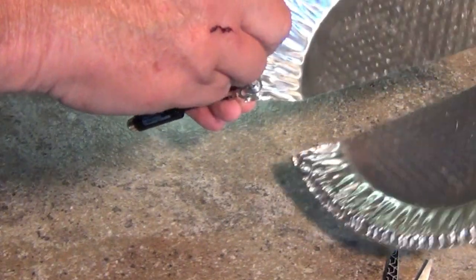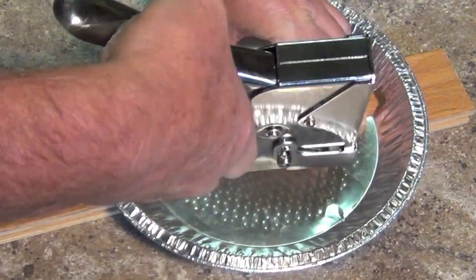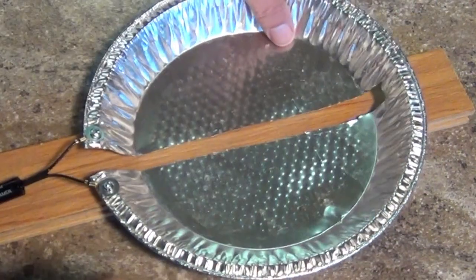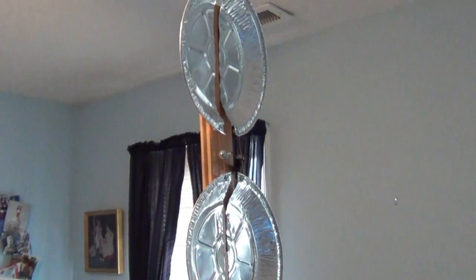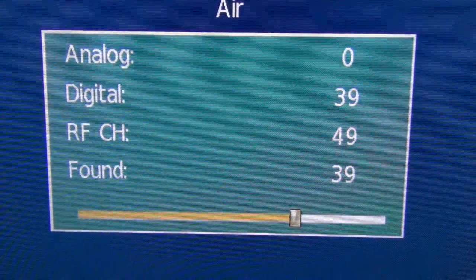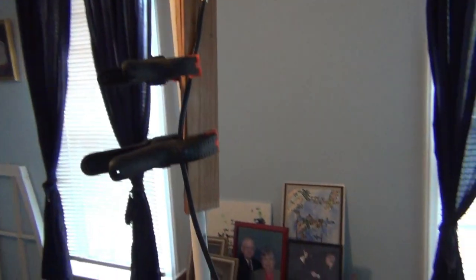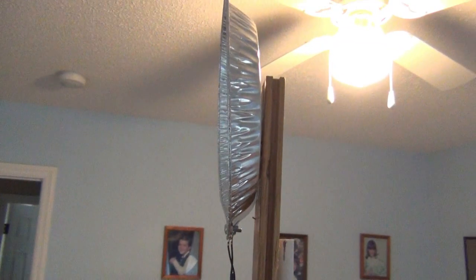Some of you want to know if I could do something to enhance the performance of this antenna — maybe in your location it just doesn't quite get the reception you were hoping for. After a bunch of tinkering and building, I've come up with a simple but effective antenna that I think just might help you out. So here is my second version: the two pie pan antenna. It does perform even better than the first design without getting much more complex to build. Spoiler alert — no, it doesn't work twice as good as a single pan version, but in many cases it will work better for you. If you've already made the original pie pan antenna, you can use it and follow these instructions to simply convert it to the upgraded version.